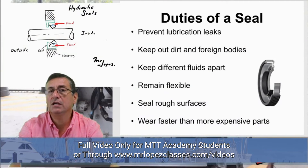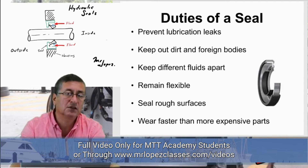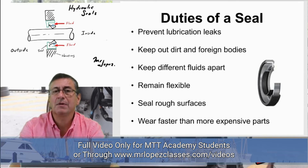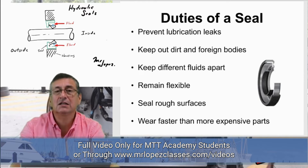The material becomes rigid for two reasons. First, the quality of the seal may not be appropriate — it is probably an aftermarket seal. Be careful and always replace with original seals. Second, dramatic temperature changes between parts produce deterioration of the seal material. Also be careful when the shaft is damaged, dented, or cracked — the seal is immediately destroyed.